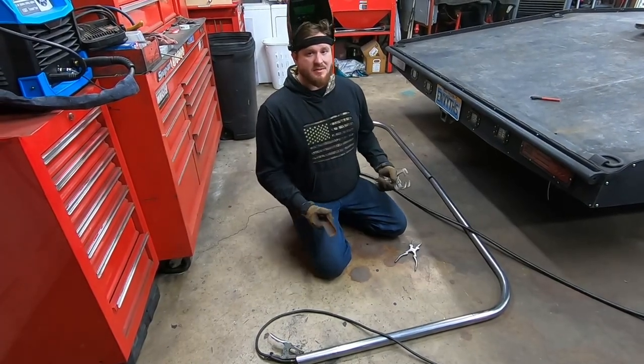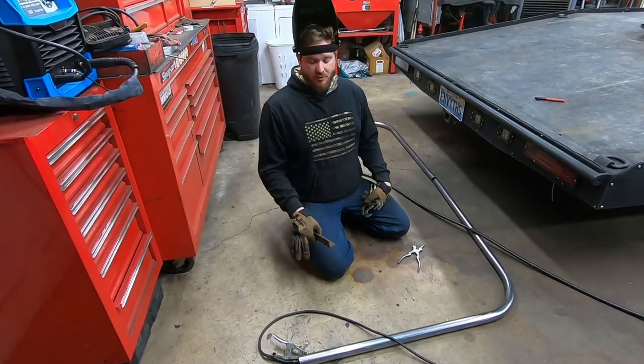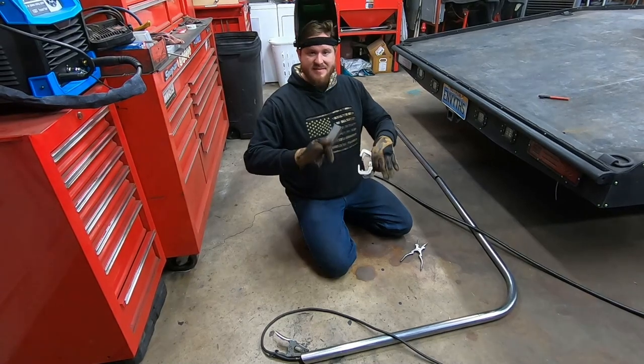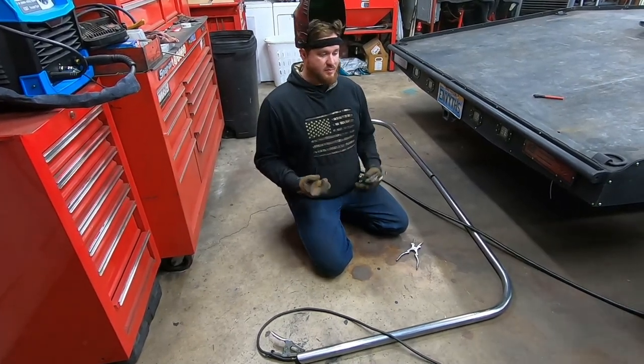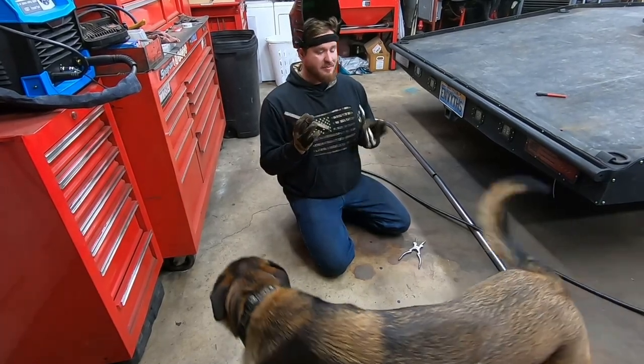So we're gonna be using a couple easy techniques to try and get our hoop set up for the rear hoop, and that's using the floor to keep one of our planes level. The other thing that we're gonna be doing is we have to merge the two pieces of pipe together, which we're gonna be using a piece of angle iron and a couple of clamps for.